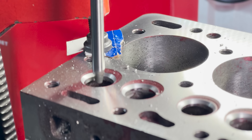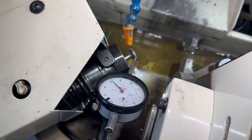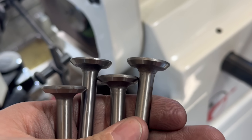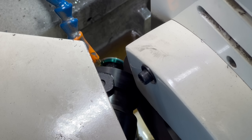It's not uncommon to find valves that aren't ground well out of the box, especially on something that's new old stock, but when I started grinding these I was amazed at how far off they were. After taking a closer look, I noticed that it's very likely that someone had reground these valves very poorly somewhere along the way, based on the differences in the thickness of the margin and the valve faces. They'll be okay, but this is why we often like to regrind valves even if they are new.